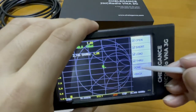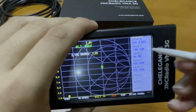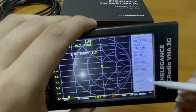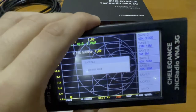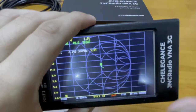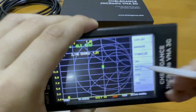And now the calibration is done. Here we're going to save our calibration result in one of the channels, so that the next time we come back to the same frequency range, we don't have to calibrate again. I will just put it to channel 4. The calibration is all done and we are able to start testing the cable loss.